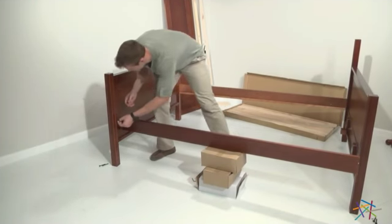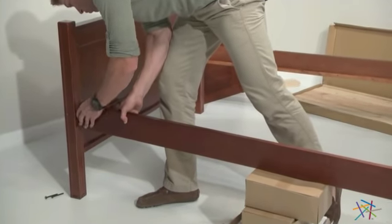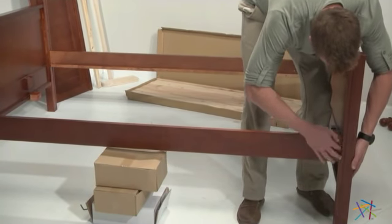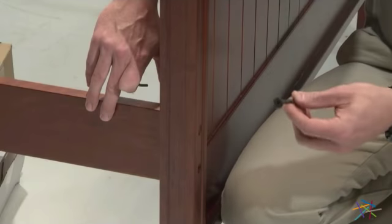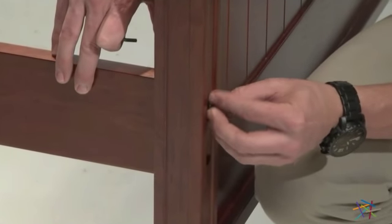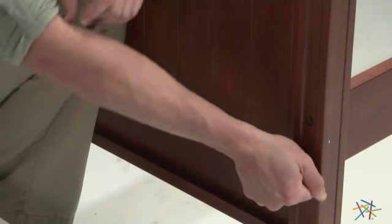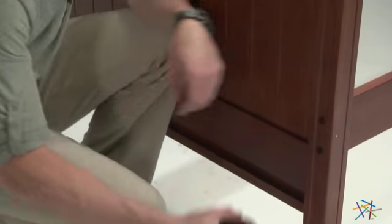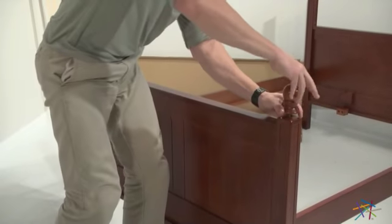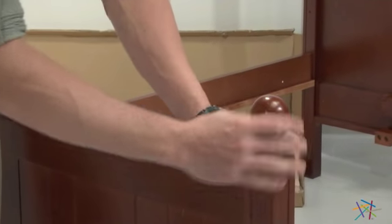Moving to the front rail, preset your dowels in place and with your support boxes or assistant simply line up the holes. Open up the frame a little and slide into place. Move to the outside with your two long Allen bolts and repeat for both sides — hand securing first, then finishing with the Allen wrench. Once all four sides are secure, attach the post finishes: remove the cap, insert into the hole in the top of the post, and hand secure. Repeat for the remaining three.